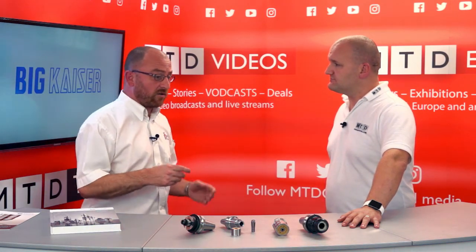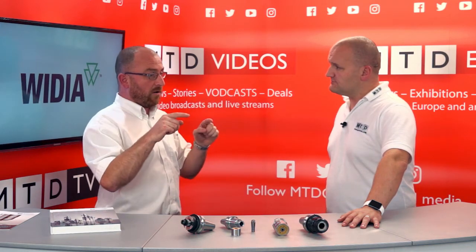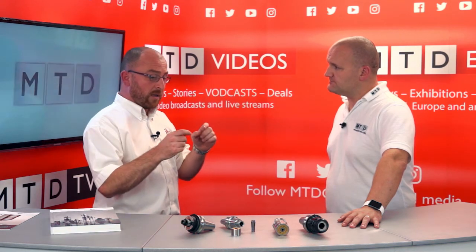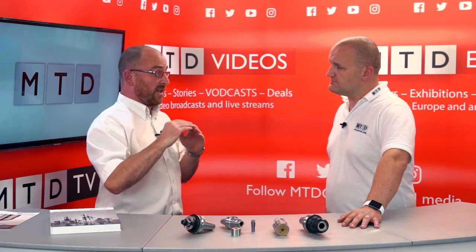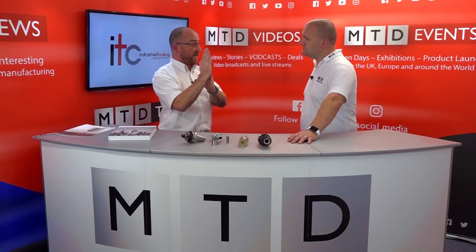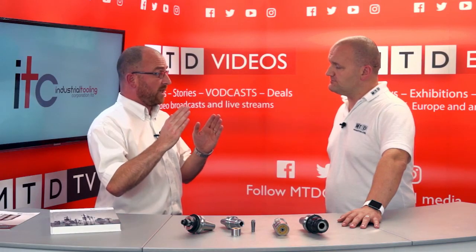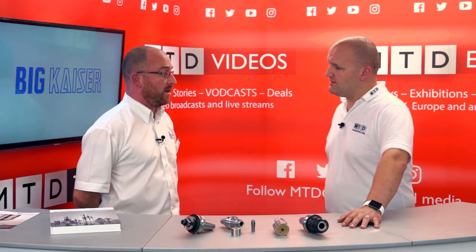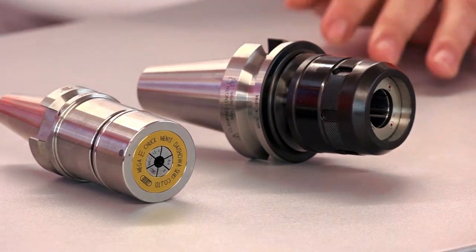In tests that we did on standard BT holders on a spindle, we're looking for a taper contact because the standard doesn't have the face contact as well. On tests that we did, we found anywhere between 20 and 40% contact, that's all. So if you imagine when you're putting side load on anything like that, it's going to move within the taper. With ours, if your machine spindle is still manufactured in spec, we guarantee 80% contact on a standard BT or DV taper.